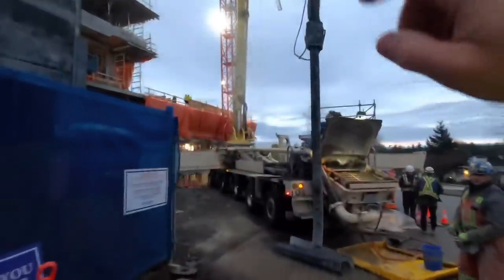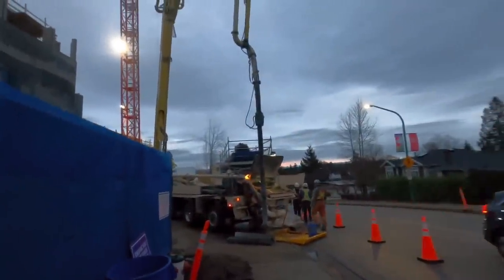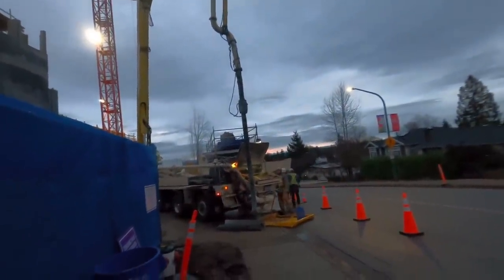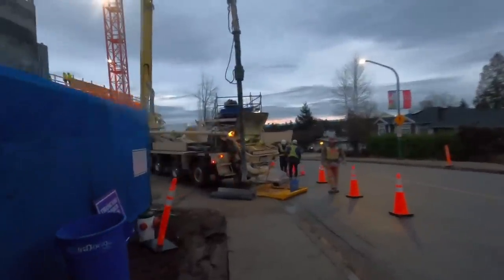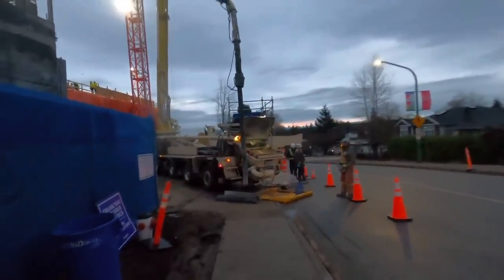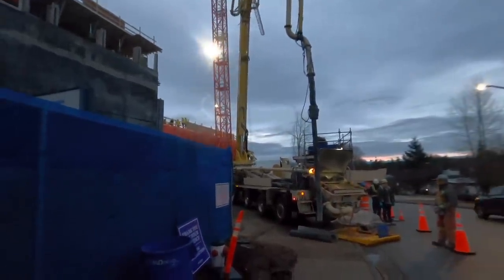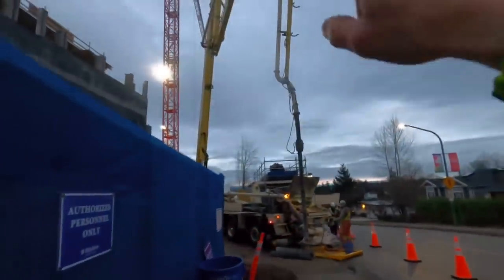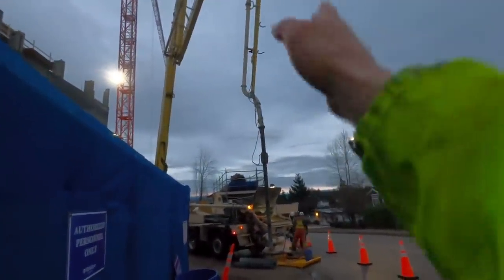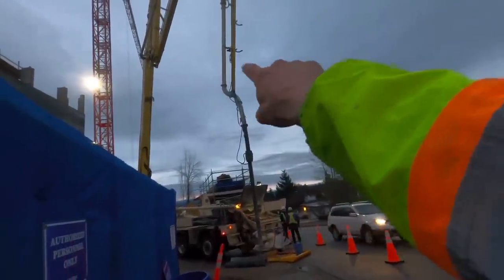While we're waiting around, we're actually going to prime this thing through in a Z configuration. The beauty of bentonite is you can prime through any way your little heart desires - it pretty much idiot-proofs the whole process. The reason I'm priming in a Z: when we stretch out onto the deck, if I prime through in an A-frame, concrete goes up, concrete dribbles back down, and inevitably I end up with a little bit of concrete in that last pipe or elbow.